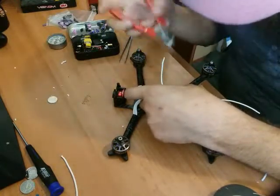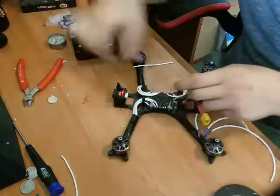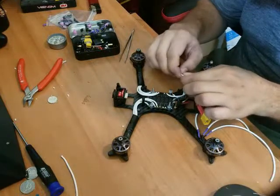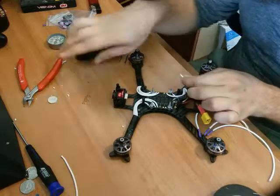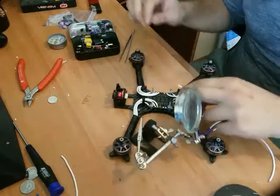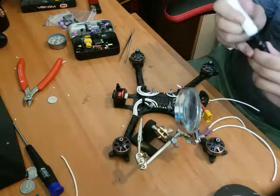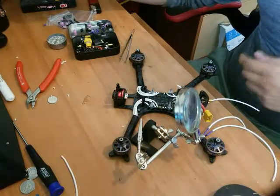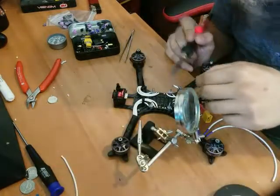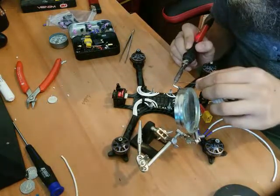This one, I'm going to do another snip right at the edge of the PCB. Check on the excess wire pile. Again, twist the wire in my thumbnail and bam, perfect. That's beautiful. I'm gonna grab that guy, we're gonna throw a little flux on it, and clean that up. I need a little tin on that tip. That's better. And there we go.